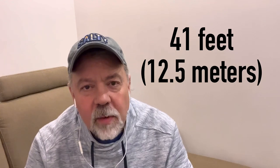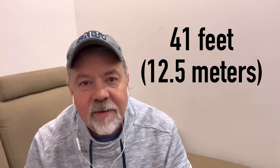My thoughts on 41 feet is that it's almost a 5/8 wavelength for the 20 meter band. So I'm going to start out sloping, but as close to vertical as I can get. A 5/8 wavelength vertical is a DX monster because of the takeoff angle. I won't achieve that takeoff angle, but I'm going to see if that length works and what kind of DX I can get. With 41 feet, it's one of the shorter sizes for random wires. I know people usually build them a lot longer, but I want to try 41 feet and see how it works for me, especially for DX.